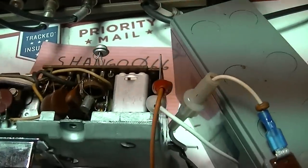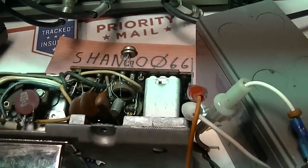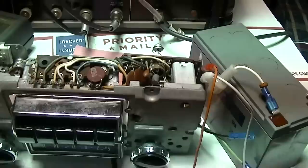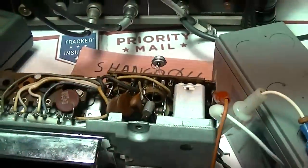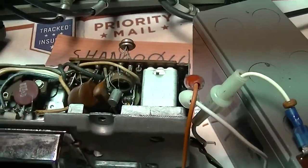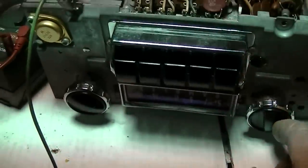This is a GT313B UHF transistor and it's a much higher frequency than the MP20. I noticed with this one that the sensitivity is much better at the top of the band — it kind of went dead at the top of the band before.